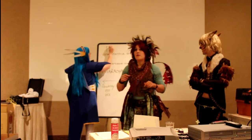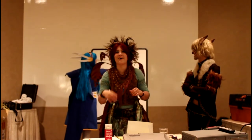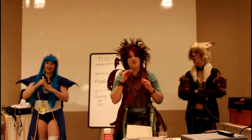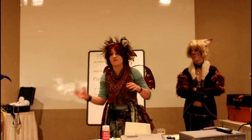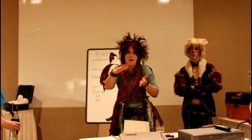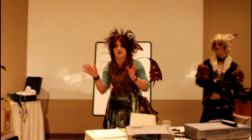Thank you. And then I have a question right here. Actually, she answered my question. Oh, you're ready then? Okay. Back here? How do you prevent the drips? It's just going really, really light on it. The trick is really, really light coats, and then let it dry. Because if you come back and it's still tacky, then you're going to get wet paint on top of wet paint and it'll never dry. So that's the trick. It's going to be annoying, just light as you can each time.